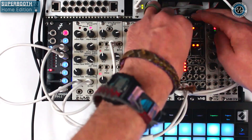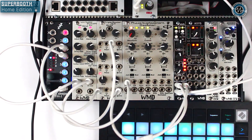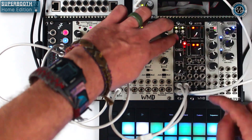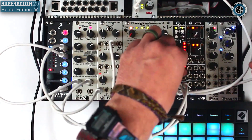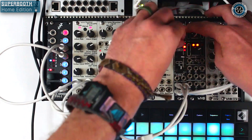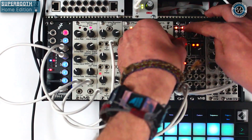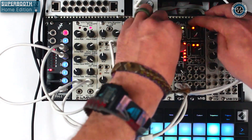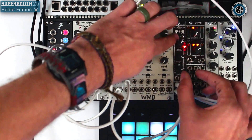I like this filter — I want to save it. All I have to do is press this morph preset button, and now these become your nine preset slots. I'm going to save this one to slot one by pressing the top button while holding morph. Let's make another filter — I'll go back to the low band, give it its lows back, create something kind of raunchy. I like that one, let's save that to preset two.